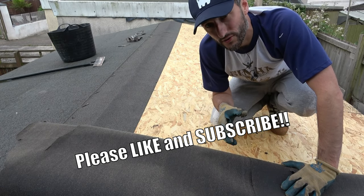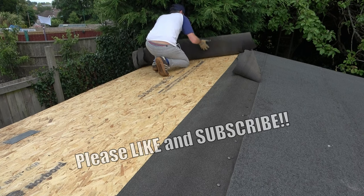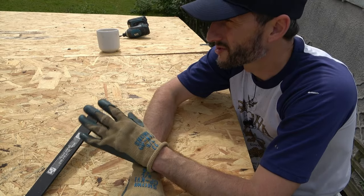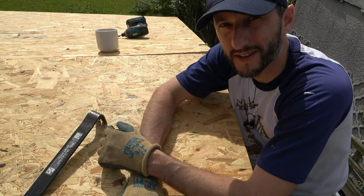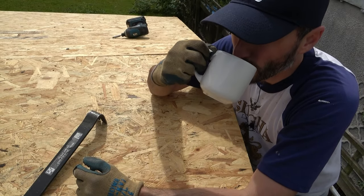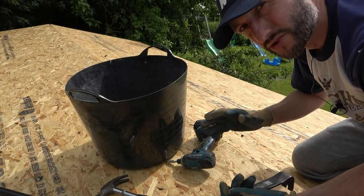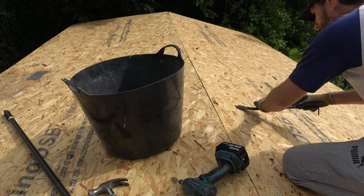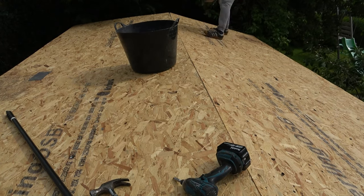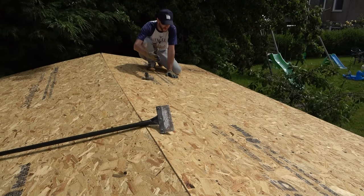Surprisingly as I started rolling the felt off the nails were popping out inside the felt - going a lot quicker than expected. However on the other side of the roof it left pretty much every nail in the timber, so it's back to removing all the nails. Using a pry bar and a tub to catch the nails, I'll work my way through and remove them - straightforward but extremely tedious. With all the felt removed I didn't have to use a scraper as it came away quite easily, though I did have to go around and remove all the nails.